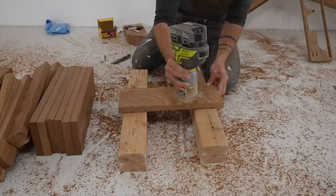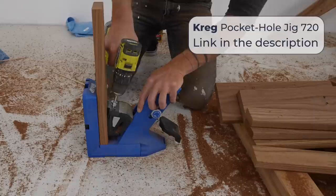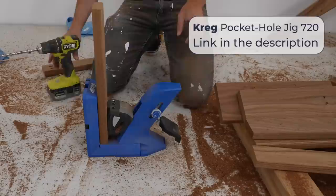Ash is a pretty hard wood, so rounding over the edges is nice just to keep them from being too sharp. I'm using the Kreg 720 Pro pocket hole jig — I really like this unit, it's fast and easy. It actually allows my designs to be a lot thinner and more streamlined, because with pocket holes I can keep things more flush and less layered.